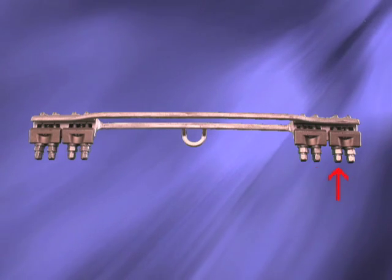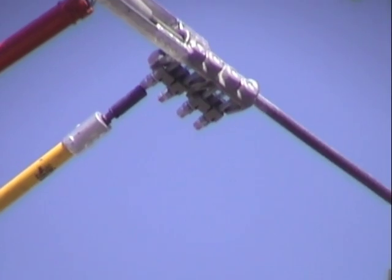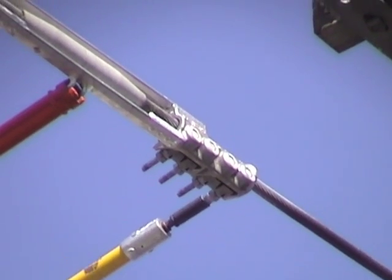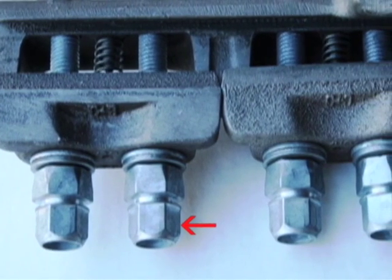This is of particular importance on larger units with three or more layers of aluminum stranding. A hydraulic nut driver with an extension stick will substantially reduce overall installation time. All ClamStars are supplied by the factory with pre-installed torque limiting nuts containing a top section that is designed to snap off when the correct torque level is reached.